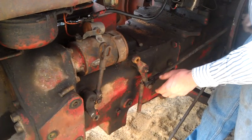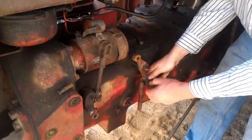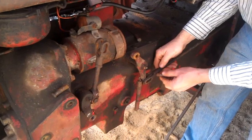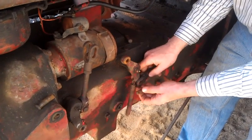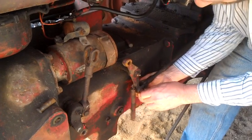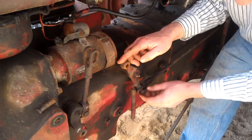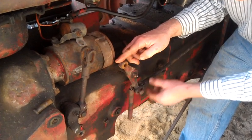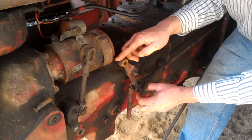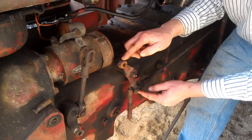This lever here — lever pushed forward, so it's up by the dash, pushed forward. You turn the turnbuckle on this until when you push this back, you push the pin in the bottom one. When you push it back, there's about an eighth of an inch left at the front — so it's a little bit loose in the saddle there. You want about an eighth of an inch left right there, so I'll push that in. Now I have about an eighth of an inch left when it's tight.